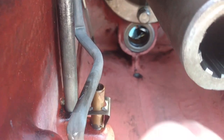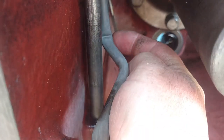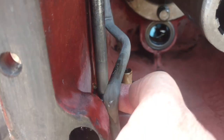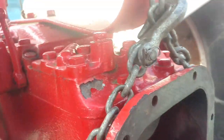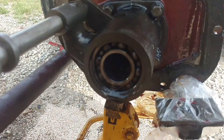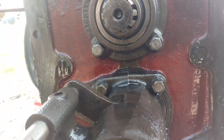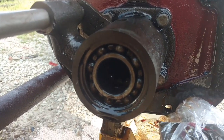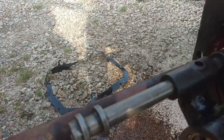With the exception of the pickup tube on the PTO — if you can see right here, it's got a kink in it. I'm going to take that off the parts tractor and change it out. It comes out of this valve body right up here. At the same time I checked the sleeve and collar, the PTO and engine, the main drive from the transmission to the rear end — everything feels good, the bearings are good, there's no slop. Now the shift fork will go back and forth nice and easy like it's supposed to.